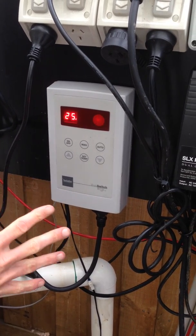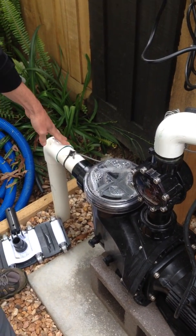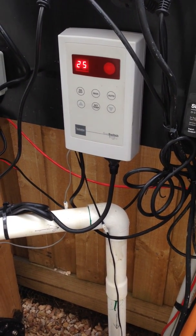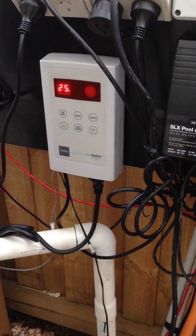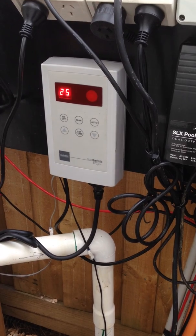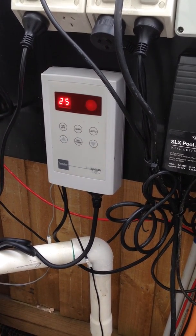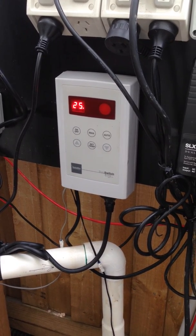So if I want to find out what happens to get this - we have a sensor going into our solar pipes that reads back a temperature, and we have another wire which runs up onto our roof and gives us a temperature for our roof. What the operation of this machine in its default position will do is: if that roof temperature becomes 7 degrees above the water temperature, automatically the solar pump will kick on, saying it's an efficient temperature to enable the increase of the water temperature by the use of the solar.